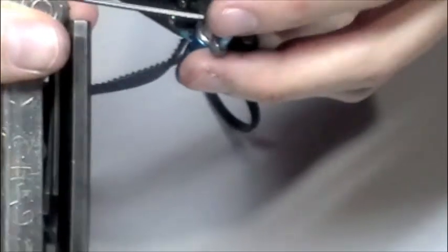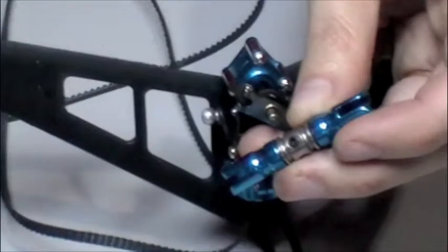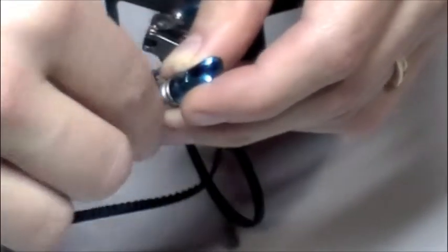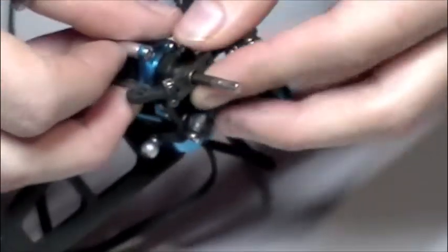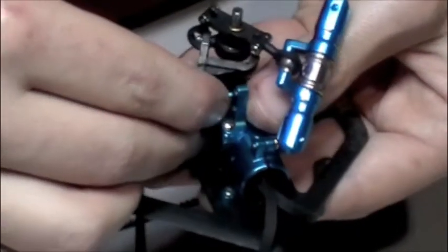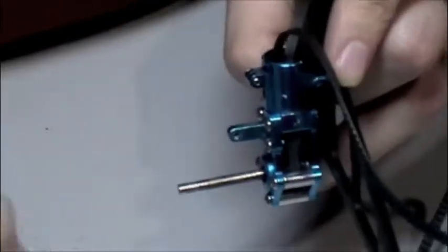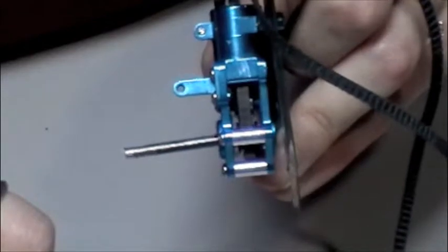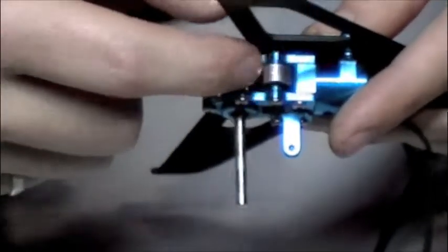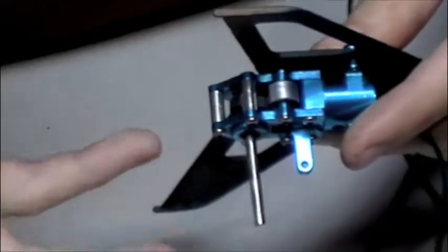Someone really put the Loctite to this. I should take that set screw out so that I remember to clean it and put fresh Loctite on it. And that's the whole thing. And the shaft is fairly obviously bent. Next, this whole plate has to come off. And I'm going to take that belt idler pulley off too, because those cause problems, apparently, from what I've heard.